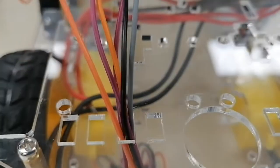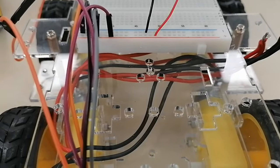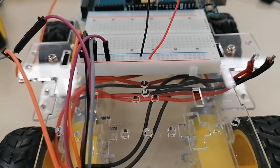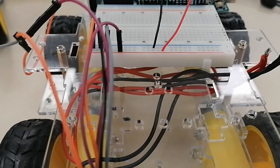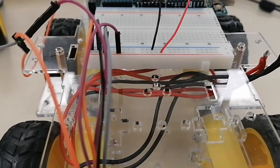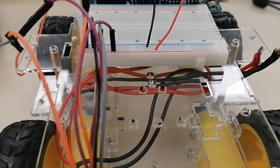At the top of your car chassis, there must be 3 wires connected for each sensor. One is for VCC, another is for ground, and the other is the signal, to be connected to a digital pin of the Arduino Mega. Do all the connections for the 5 sensors, but make sure each signal has a different pin assignment. That pin assignment will be your reference when you are doing the programming or testing.